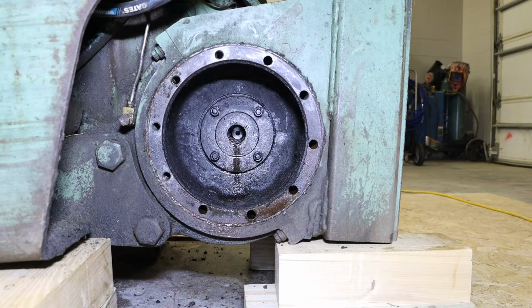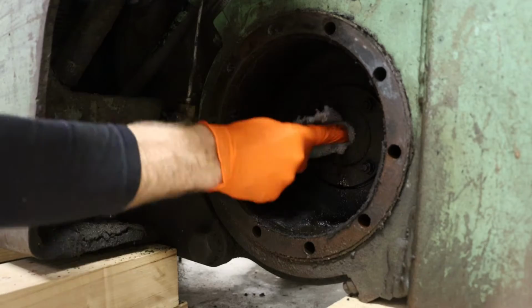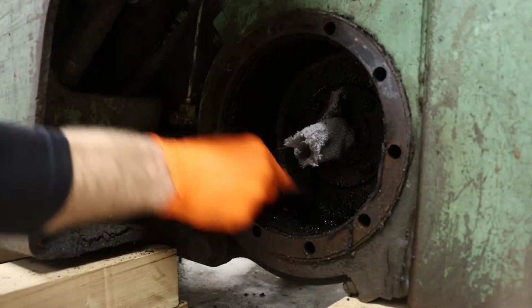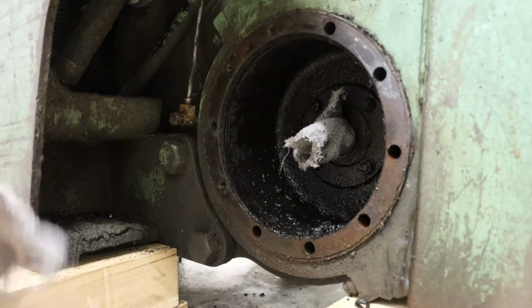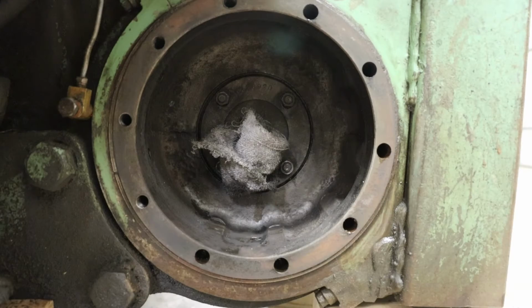To get a clear idea of what we are looking at, we have our 10 bolt and nut locations. We have our centermost point, which goes into our transmission. We have our brake line that we removed out of the way. And we will do a little cleanup on the inside of this before we get too far. Using some Amsoil brake and parts cleaner, as well as a scraper, I can clean off as much of the debris as I can and come back with a rag to get the rest. And with that cleaned up, we're looking a little better.